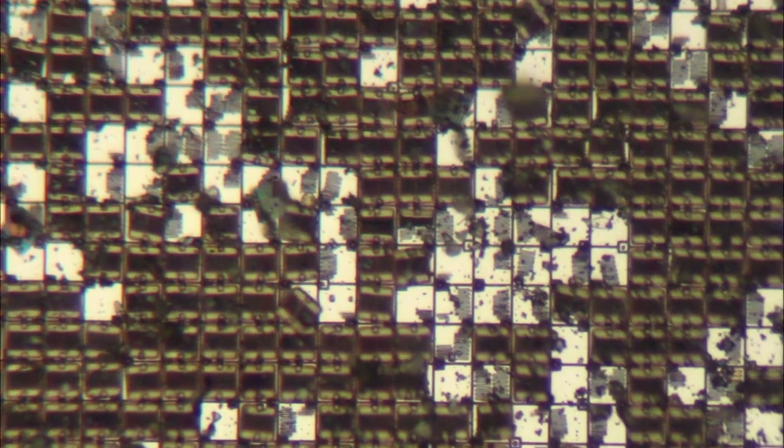One problem was I forgot that these things are basically like MEMS devices. So when I was cleaning all the grot from sanding off the spacer I used compressed air to clean it, and it's actually blown away quite a lot of the pixels unfortunately. But you can just about see the remains of those black areas — those are the actual pixels and they're sitting on some very thin supports. You can just about see these little springy supports, which are providing thermal isolation between each pixel. It looks like we've got these springy supports and then the actual pixels sit on top of those — they're separate discrete pieces of presumably vanadium oxide or something similar, which provides a change in resistance with temperature. Most of the pixel is black, which you'd expect to get plenty of absorption of heat, because these are basically a big array of thermistors.